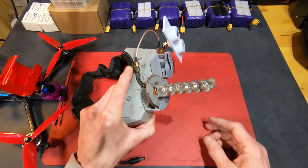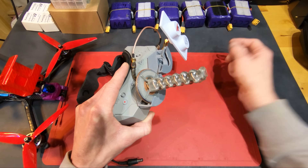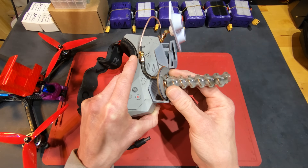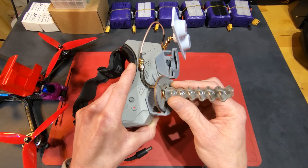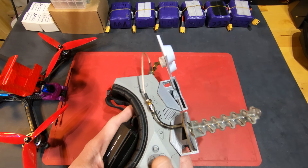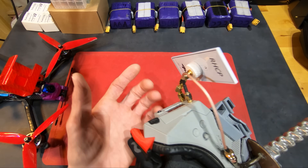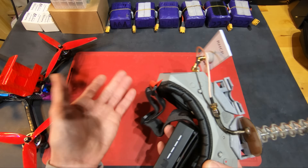That's the antenna setup I'm using now. A few months ago I was just using two homemade helical antennas, but now I've switched to using one of the X2 Airs, which is better than the helicals. The helicals were really cheap — about $5 each to make — while the X2 Air is $60 US. I might do a video about how to make helical antennas. For flying long-range, I always use two high-gain antennas pointed in the same direction to make the best use of Rapid Fire Mode 1, which combines both antenna outputs for the best picture.